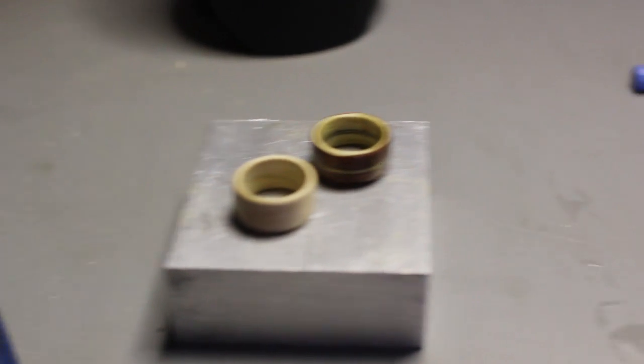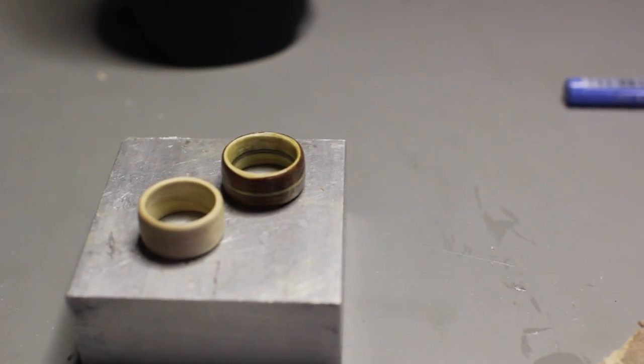And that's it — it's done. To finish it you can use different waxes or sealers, but a lot of people will just coat it with CA glue. If you fully coat it and carefully wipe it down, it becomes waterproof. That's kind of the easiest option since you've already got the CA glue from making it.